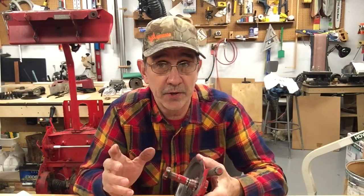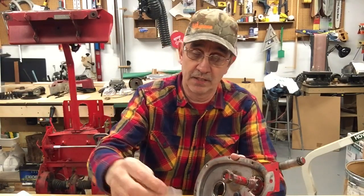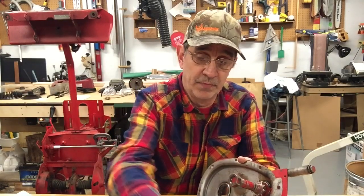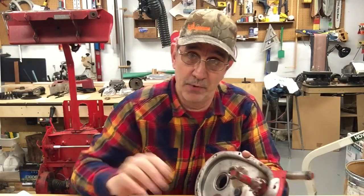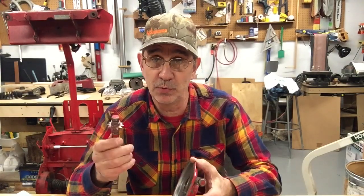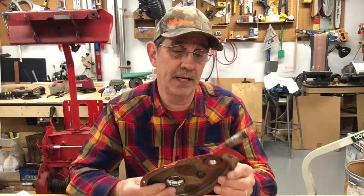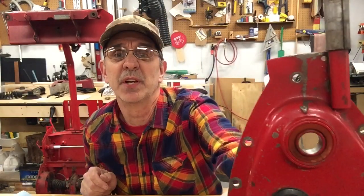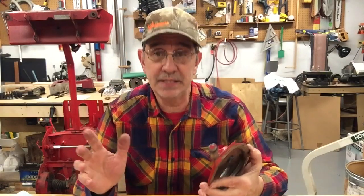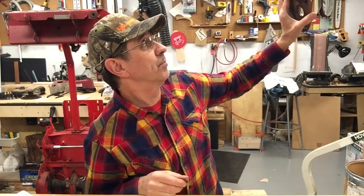This is going to make it a little harder to get apart next time you tear it down, but it's not impossible. This is not a thread-locking material — it's a retaining compound. It just fills gaps, and that's what you want: fill the gap between the sprocket and the bearing. On these chain cases you also have another bird mouth — hammer that down so it's closed, and if you look up at a bright light you can tell if it's fully closed. Personally, I weld them shut to make sure they're not going to leak.